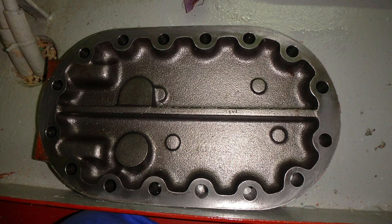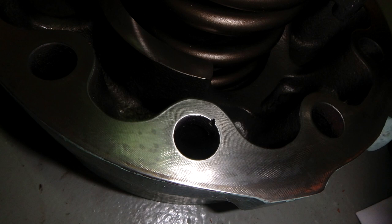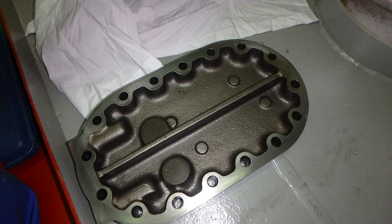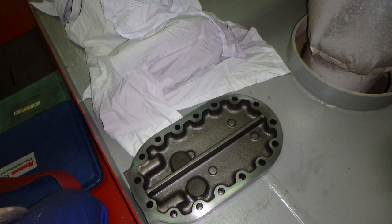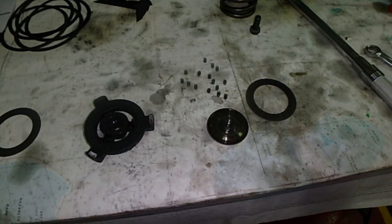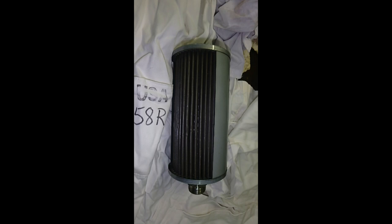Check also and clean the parts of the air condition unit. You can clean the motor from any dust. You can check the belts, the tightening of the belts. And also what we do else, for the recovery bottles, we enter how much we recover, how much freon was removed from the line. We have a place in a book, an environmental book, where we make an entry there also.